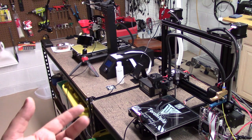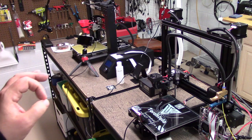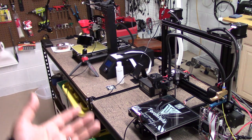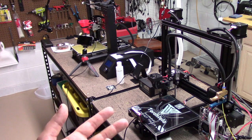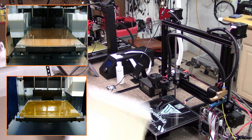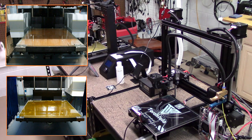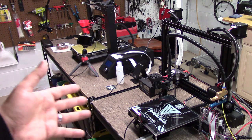Now, you can argue that putting PEI over glass might be a good thing to level it out, and that could be. On both of my DaVinci's, I have it over top of the glass — I have the adhesive on the glass, and then I have the PEI on the glass — and that works okay. These other printers have it right on top of the beds and they work fine too. I haven't had a problem, and I see no issue putting it directly on there.